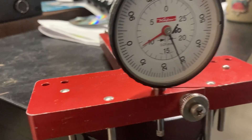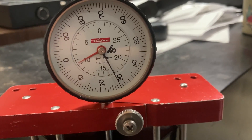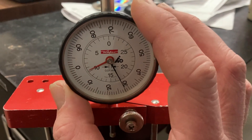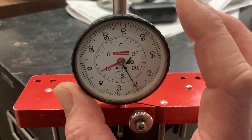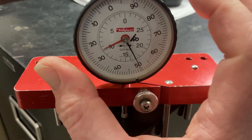Watch — if I go to another table corner, that reads 9.28. So find a corner of the table you're happy with and adjust it there, but don't change it afterwards. I like this one better because the arrow's at the bottom and I like the five being close to the bottom.